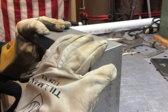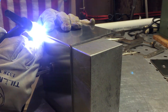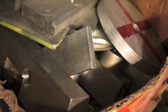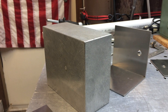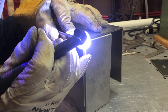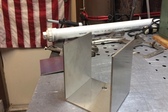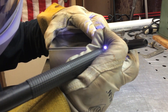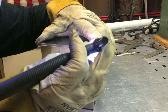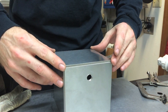For doing outside corner joints like this, having some blocks of aluminum laying around is super handy. Both Roy and I save all the blocks of aluminum we can get our hands on, as well as steel and stainless steel, because they come in super handy for chill bars as well as backing for outside corner joints. You can see how easy it is for Roy to get a 90-degree angle — with one hand pinch the parts together, and with the other hand get a really quick fusion tack. Then you're sure you have a nice true 90 degrees. After Roy gets all four sides tacked up, he's going to double check with a little square before locking them in by putting the bottom on.